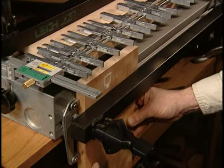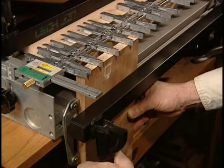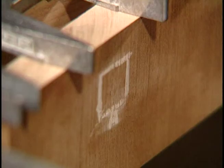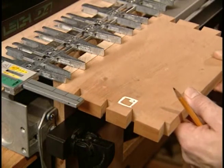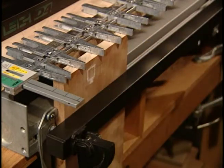Clamp a test pin board against the left-hand side stop, outside face away from the jig, with the top end flush under the guides. Through Dovetail pins are the only boards on which the outside face faces out on the jig. Place the side edge of one of the cut tail boards flush under the guide fingers and mark a pencil line partway across the pin board.